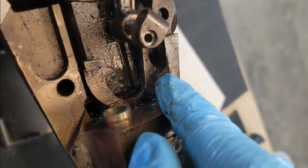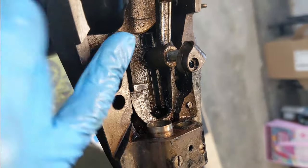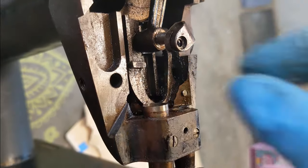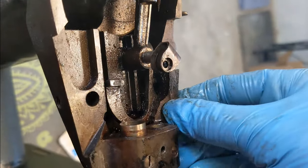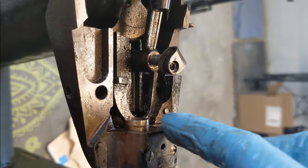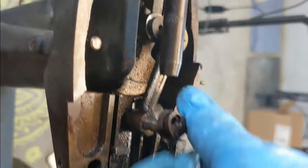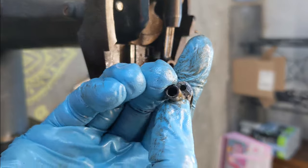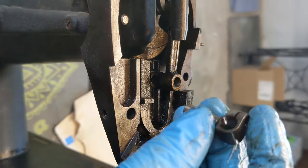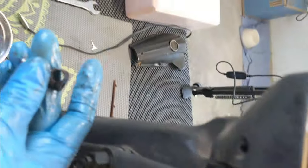Looks like there's a pin here that is holding on to this. This is the part that — when you lift the presser foot — comes over and pushes up against the tension and releases tension, so you can pull your threads out easy. But it looks like it's being held on by a pin. I can feel a hole on the back side — if I wanted to, I could push it out. There is no screw in the back, which is interesting. On the domestic ones, there's always a screw in the back. I'm going to put this with my needle bar.